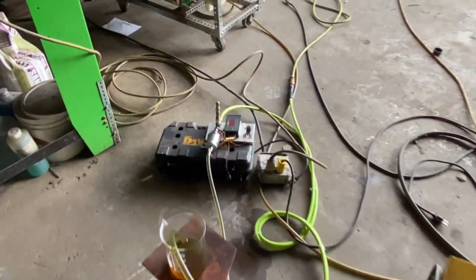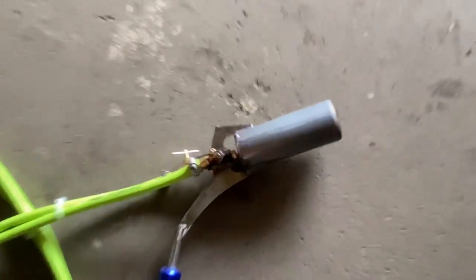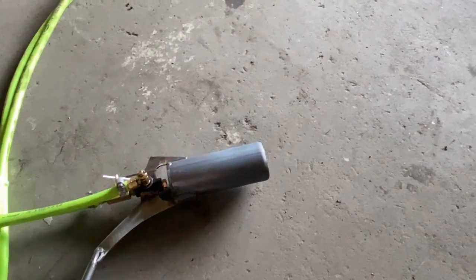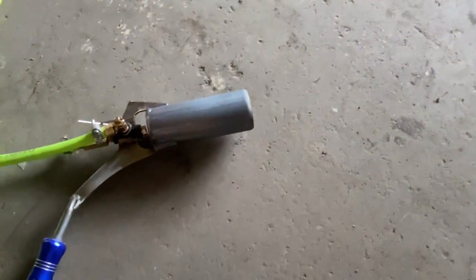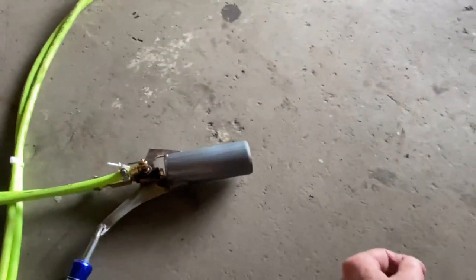The accumulator worked amazing, as you can see. Now we're going to remove this nozzle and bore out the air nozzle — the velocity is too high, I can tell. Before I can reach the high-velocity flame we have in mind, the turbulence becomes more than this combustion chamber can handle and we get a flame out — the whole thing is just thrown right out the combustion chamber. We need a higher power, high-velocity flame because I can't have a big, huge, feathering yellow flame out here.